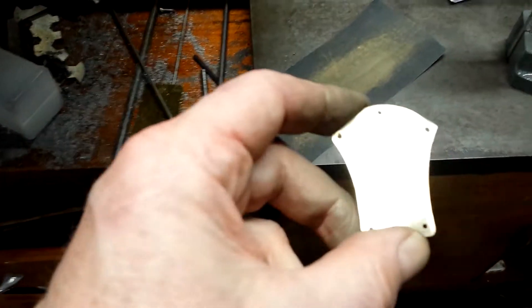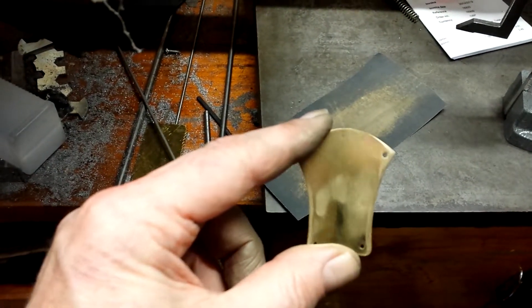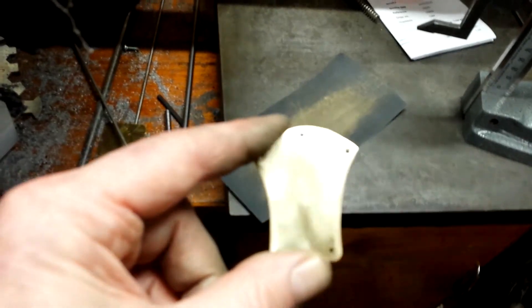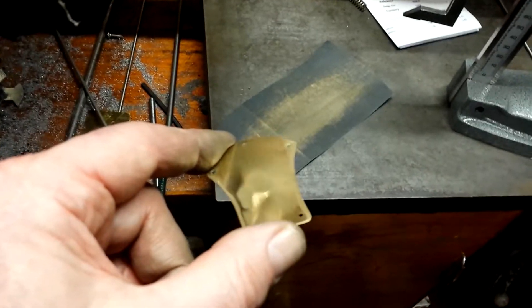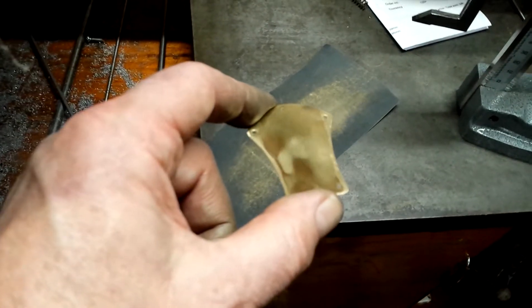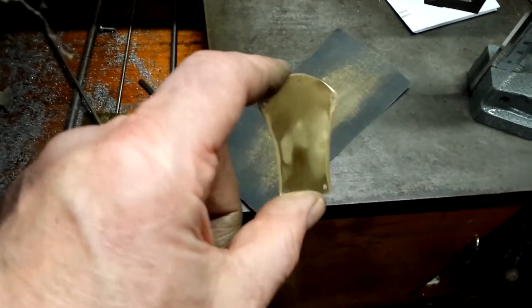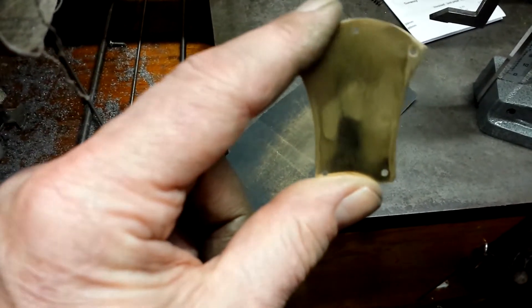I've decided to change tack and I'm finishing it off on some fine-grit paper on the surface plate, because it's producing a shinier finish than the diamond lap. You can see where it's shiny and where it's still not shiny. I think by the time it's all shiny it should be pretty flat, because I can hold it more flat on this than on the diamond lap, which is narrower. Worst case scenario is it's on the engine and steam leaks out — then I'll just know more lapping is needed. But actually, the way it's coming up now, I think it should be okay.